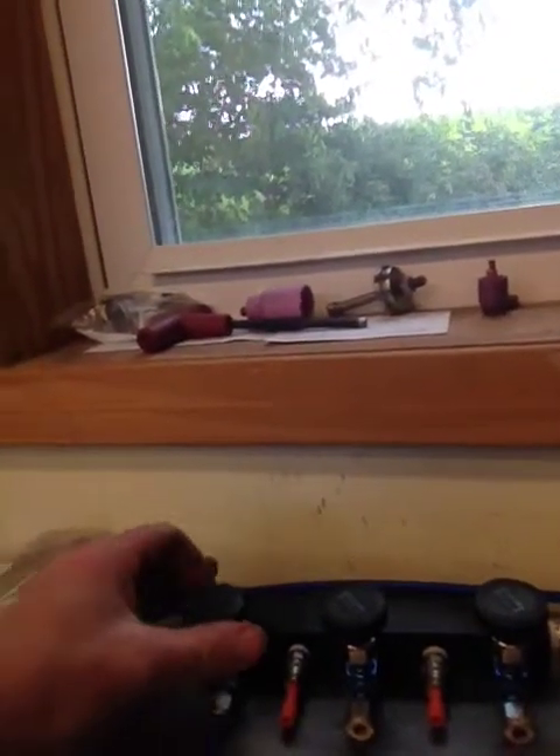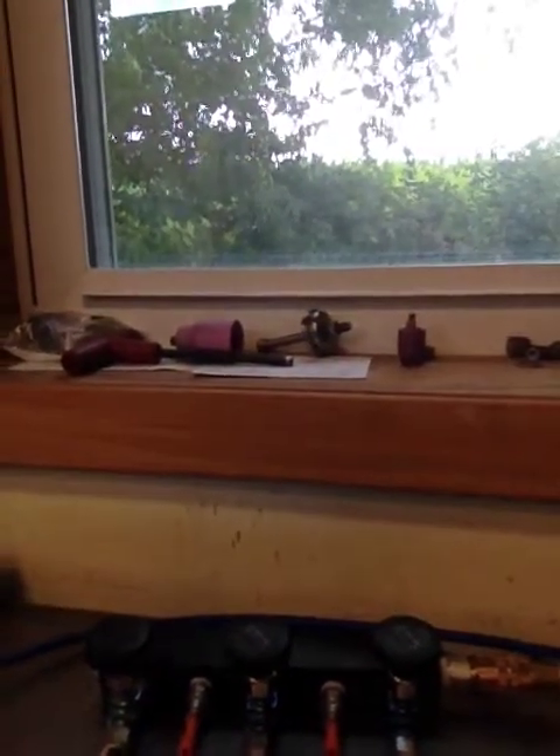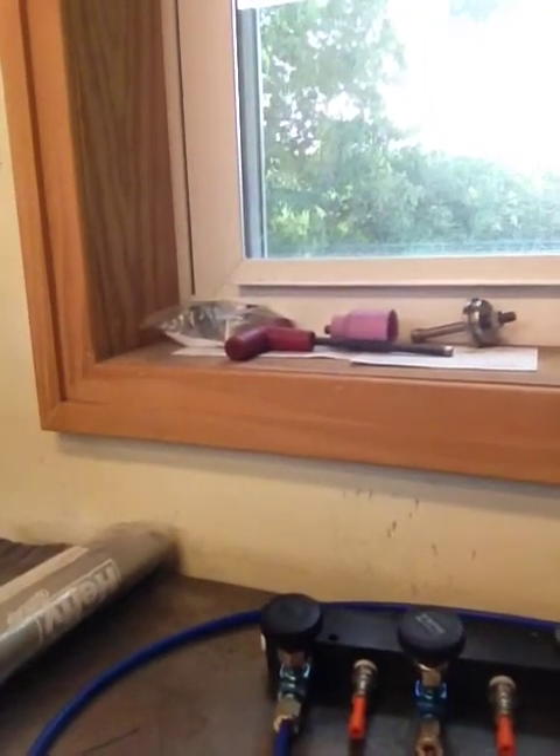Let's flip our video around here and show you the setup that we used very quickly. This is my purge setup, basically just a standard aluminum block with ports in it. I use Parker valves, which are micro adjust valves that let me truly adjust the amount of argon that's flowing through those. Just a standard machined plug for the end of that grip, and all that runs right up to a standard dedicated bottle for the purge setup. That's how we purge the inside of a love handle grip to ensure that we get the weld zone from the inside and outside completely covered in inert gas.